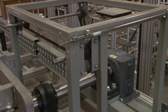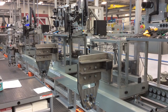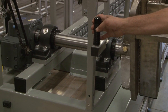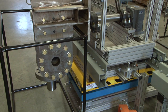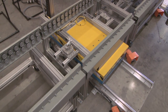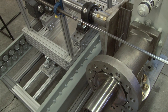The cell design provided the methods to successfully transition from a single assembler, fixed position, low-volume, high-mix program with varied assembly techniques to a lean flow cell with mixed models flowing through a series of stations with standardized work procedures. The incorporation of test and rework within the cell would yield additional benefits. The final result is a cell that more than measures up to future state volume growth projections — after dialing in the process, initial studies calculated over a 33% increase in throughput.